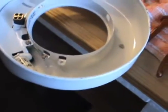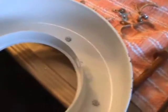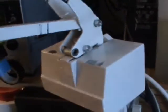This is serious. You just can't get that into position while it's in an upright state like this. It's going to have to be taken completely off its mounting. You see, a wire comes up here, front ballast, and you can just see it coming out there, and the driving lamp. So I've removed the lamp and the glass, so that if it does fall, because there's some weight on it once it's all clamped together and this whole arm wants to come down, at least I'm protecting that. I can take a recording of the lamp it uses as well. You can see its starter circuit here, look, and the transformer will be in there. Anyway, I'll carry on.